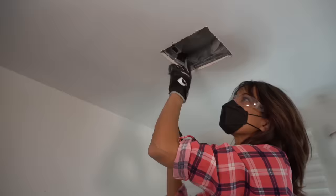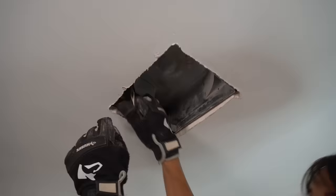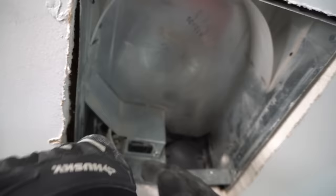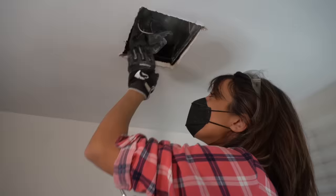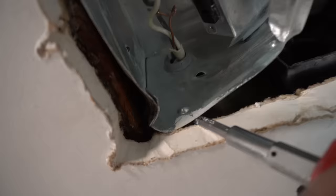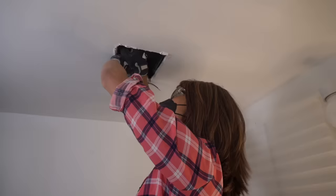Already I can tell I have a bit of a problem here because this vent is tiny — it's a three-inch vent. That's a problem. So I'm going to go over here and disconnect my power supply. My breaker is off. I've got my hot and my neutral wires; I'm just going to disconnect these and push them back up.